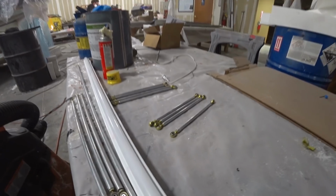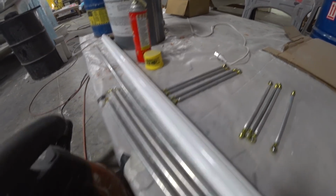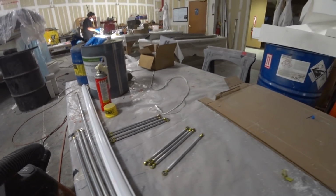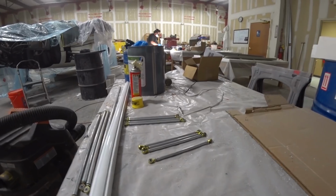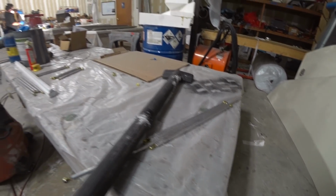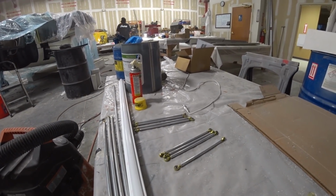And while he was doing that, and taking a break from sanding, I got these other 4 push rods done for the elevators. The material for those rods had come in, the aluminum rod. So I drilled those on the machine really quickly and then tapped them out and put the hardware in there, but you saw that last time, so I didn't need to show you all that again. So anyway, all those rods now for the elevator controls are done.